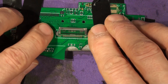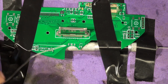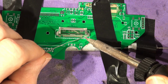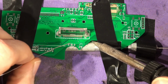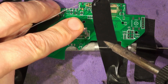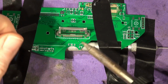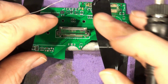And then when it's in position, this is the bit I missed on the other board, and you'll see when we cut back to the other board, this bit's already been done. So I'm going to show you how to do it here, on a new board, one of the development boards. You just touch this area here with solder. Solder that one in, and then put some pressure on it to make sure it's straight. Then have a pretty close look to make sure it's all sitting down. Look all around it, make sure it's in position. Then do the same with this one. Solder the connector in.